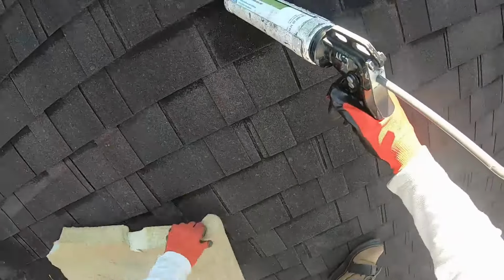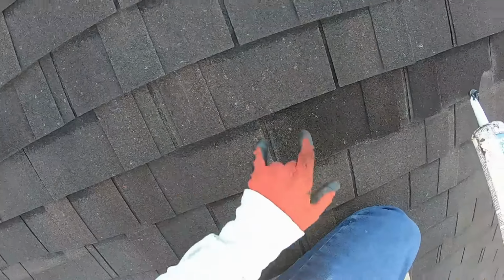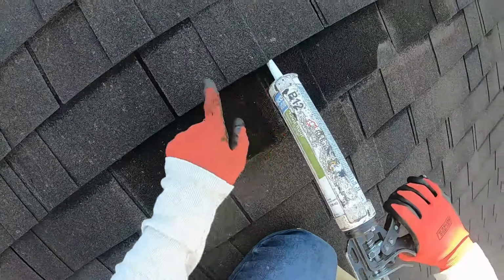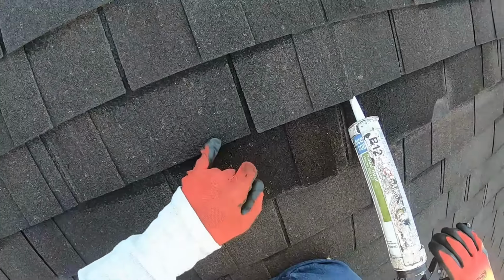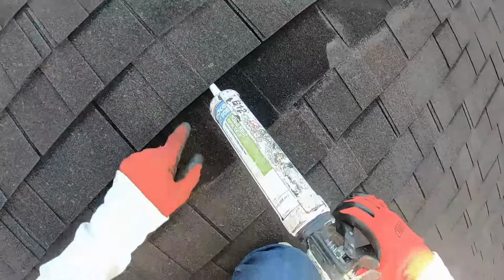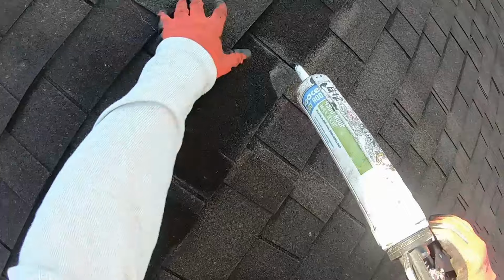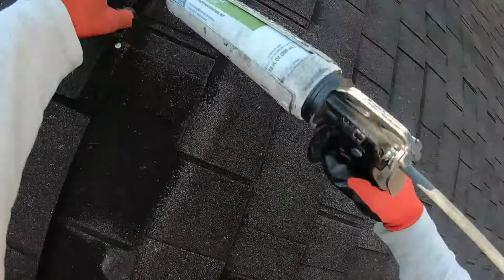And if you're gonna dab it, a couple things, basics on where you're sealing. You're never gonna seal a keyway, and you usually wanna put a sealer where your nail is. So I'm doing like a small dab here and a dab here and there. Sometimes I'll do here and here. Either way, you don't draw a line across, especially if it's dimensional, because water gets in that keyway. You don't want to trap it, run it laterally. And if you put it over a nail, it's going to stick the shingle down where your nail is. So that's just some of the basics on sealing stuff down.